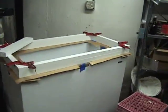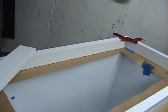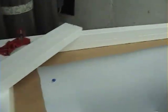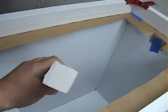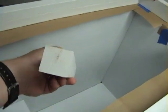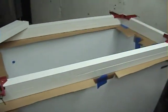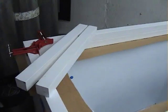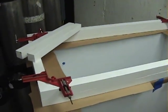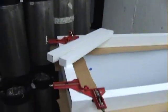Here is the freezer. The lid is off and I'm starting to build the collar. The main structure material for the collar is this stuff I found at the local big box home store. It's dimensional composite. I don't know, is lumber the right word? It's basically plastic, and it comes in a number of different sizes, mostly 1x, but they also had these bits of 2x that came in 12-foot lengths, which it turns out that a pair of these 2x's in 12-foot lengths is enough to go around the collar twice.